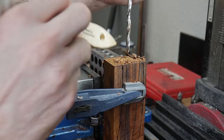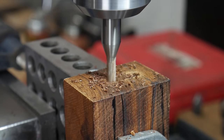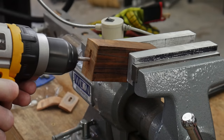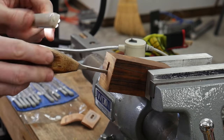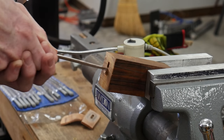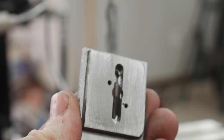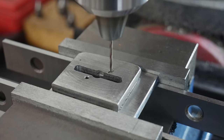This is a spot where I messed up — I didn't get the hole straight through the handle block. I didn't take time to flatten the sides of the handle block before drilling, which caused the hole to come out of the back at a slight angle. I didn't really notice until I was further along in the build. In the future I will definitely flatten all four sides of the handle block before drilling through the center so that my layout is accurate.